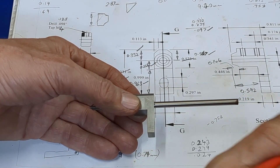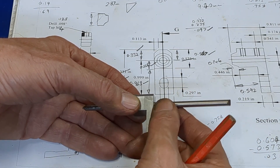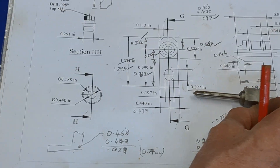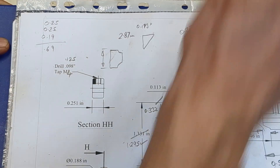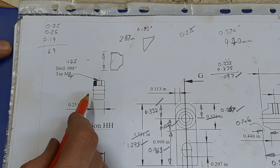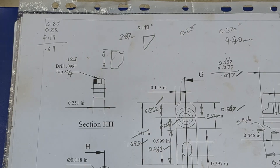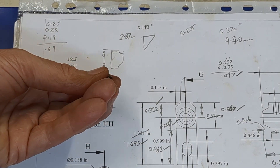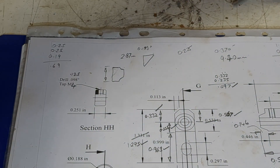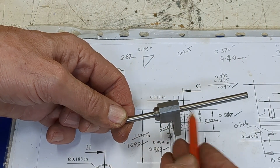The bush fits over the cutter and is used for setting the cutter in the right position using gauge blocks if necessary to get precise movement. I'd specified it as being quite narrow, only a quarter of an inch wide, but I'm going to make it a little bit wider to give it more stability and increase the diameter so that my set screw doesn't stick out too much. I want to cut a little land there which matches with the nose of the cutter so it can be used on either side.